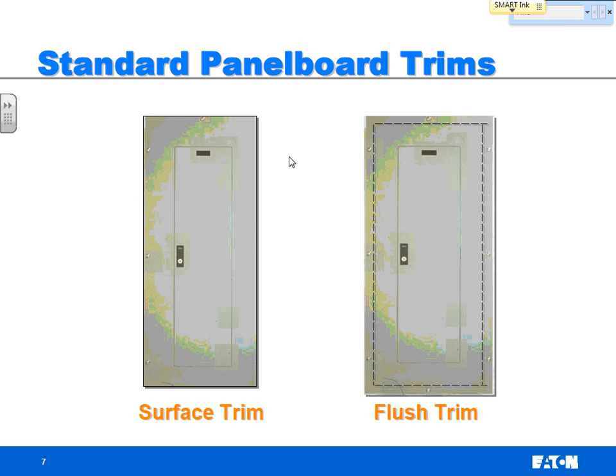And this is another one. It's important for the manufacturer to know this going in, because on a flush trim, it's the same trim, but they actually extend it out about 1.5 inches, give or take, more than a normal one. So you can overlap that space where maybe the drywall and the can meet. So your drywall guy doesn't have to be 100% perfect and pretty it up. He can keep it a little bit rough, and the trim takes care of the aesthetics to make it usable or functional in a room like this.